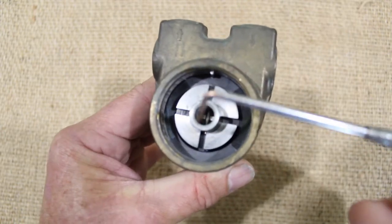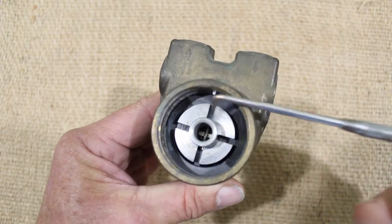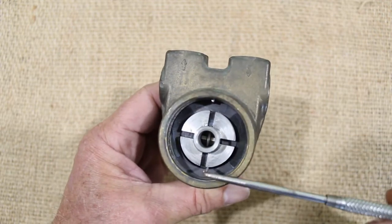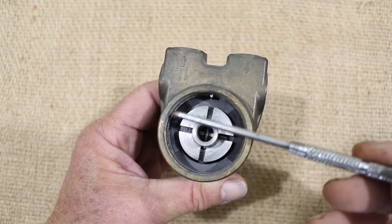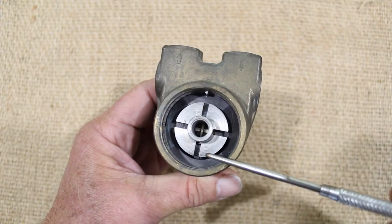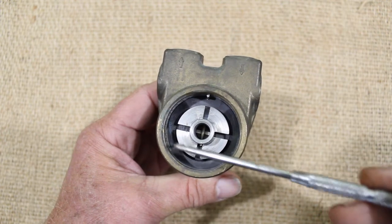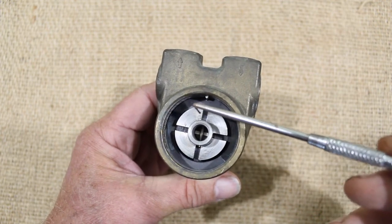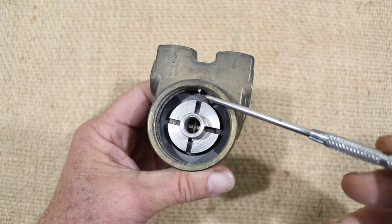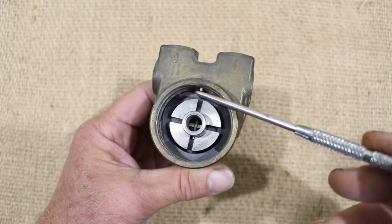We can see deep inside the cross arms, which keep the vanes in their respective positions. The vane assembly is obviously cylindrical. The housing which it is located in is also cylindrical. However, it is offset to the center line of the shaft, meaning that it is eccentric. This is how the shaft orientates the vanes within the eccentric housing and allows them to become flush, proud, flush.